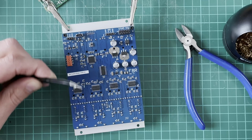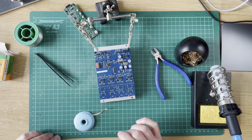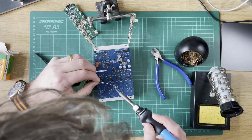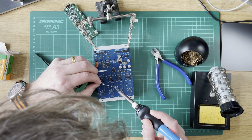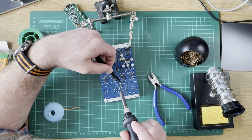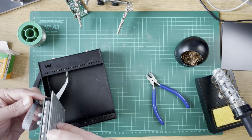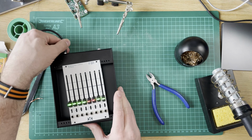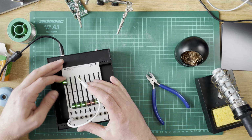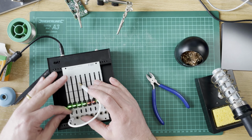We've got the little jumper wire that was connecting that jumper. Hot. Too hot. But bend it slightly, put it in position, and resolder, and hopefully drop down. And polarity switched on the jumpers. The jack should now be reversed. But predictably, of course, all I've done now is essentially break the module. It doesn't do anything. I'm not getting any voltage from those jacks. Disaster. I think I've broken it.